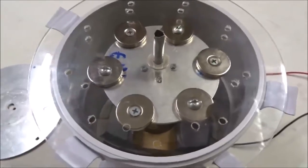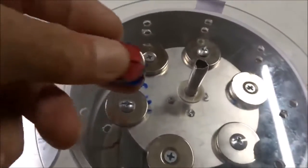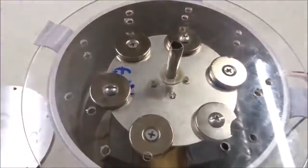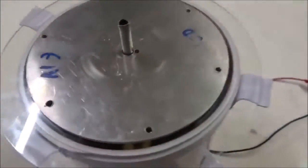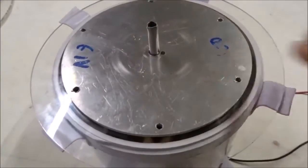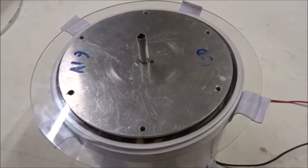Now let's see what happens when we put six magnets, NS, NS, NS, on a little DC drive motor. Here's a test magnet, attract, repel, attract, repel, attract, repel. We spin them really fast using this little 12 volt DC motor, and we put this aluminium sheet right over them. Now what should happen is the NS magnets alternating should induce eddy currents in this disc, which by induction, like a standard induction motor, should just make it spin in the same direction right along. Here we go, turn it on.